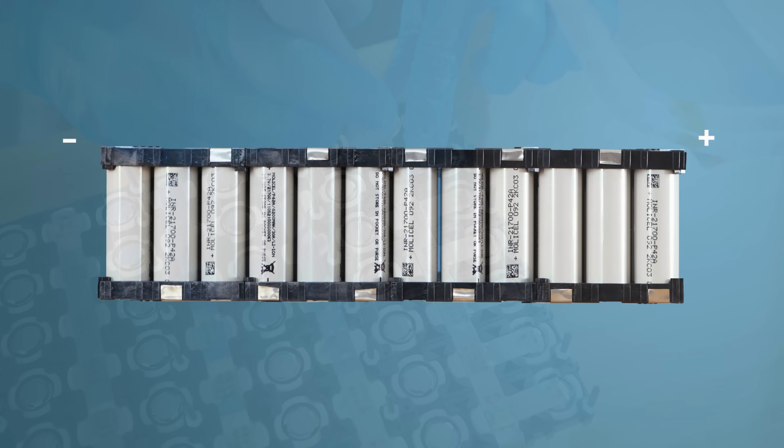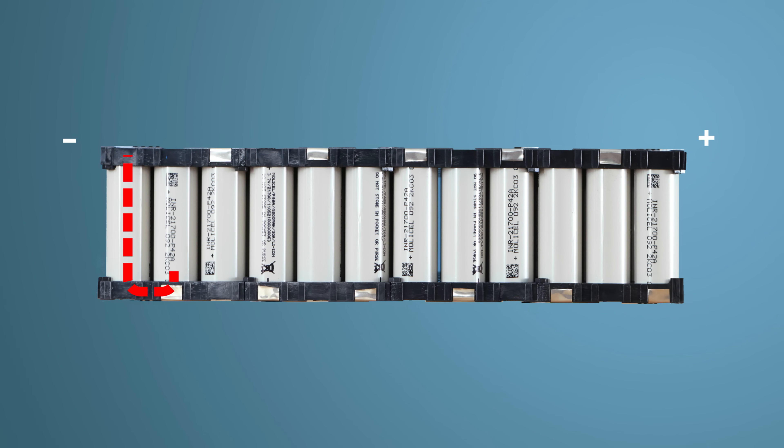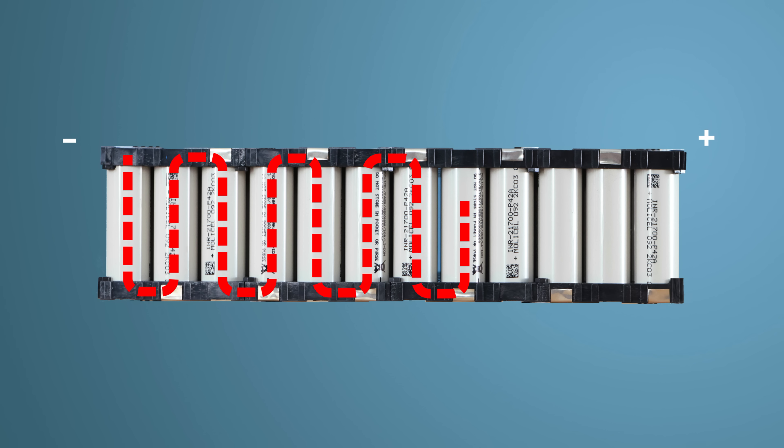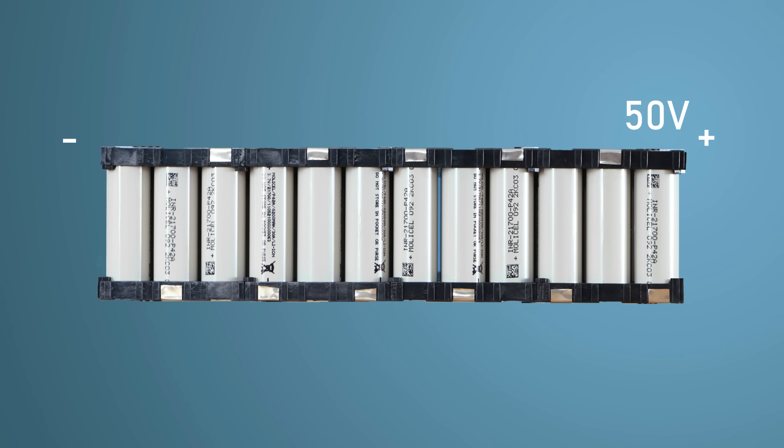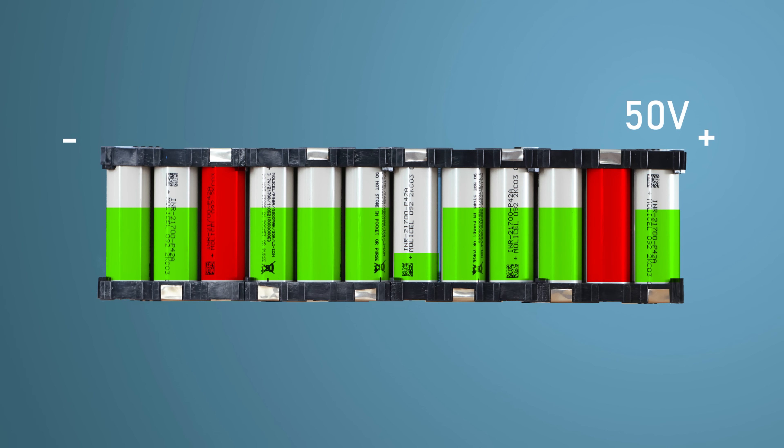With that done, the cells can now be wired up in series to add the rows together. This basically results in a current path that flows from the left negative side of the pack into the next row and so on, winding through to the positive side of the pack where it adds up to 50 volts at the final positive connection. Thanks to the folded tabs, they can be used to monitor the voltage of each parallel row. This is important because lithium cells should never be overcharged or over-discharged — if one of the rows were to have a slightly different capacity to the others, a voltage difference would eventually appear and get amplified over several charge and discharge cycles, getting severe enough to damage them.